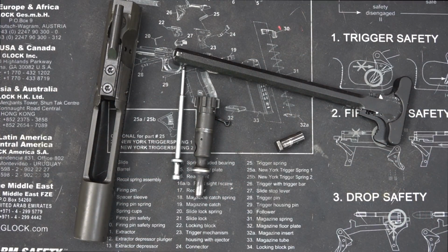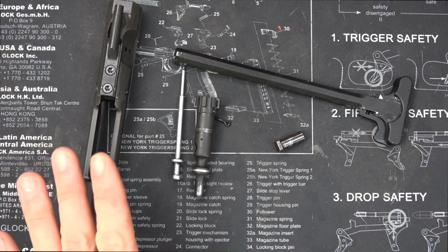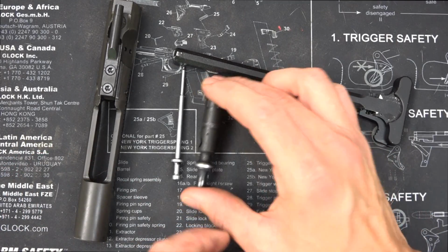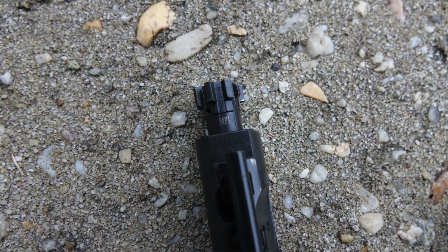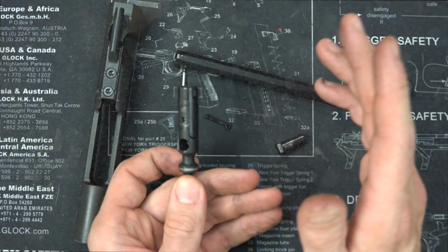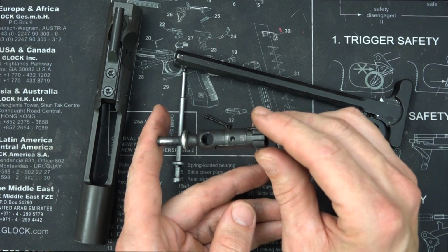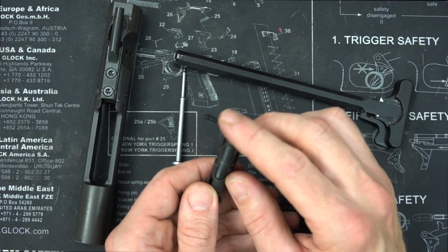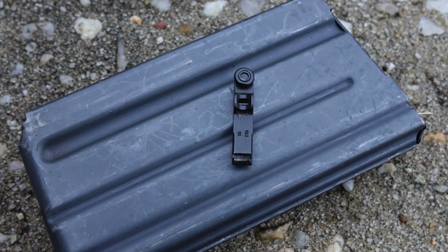The bolt carrier group certainly is one of the most important components on any AR, and this one's pretty solid. This one's manufactured by Toolcraft. The bolt is 158 Carpenter steel. It is, again, individually HP and MP tested to mil-spec, which certainly, again, you're not going to find on a lot of budget bolt carrier groups. It has the MP marking on there. And if you pull the extractor out, you'll see it does have the black insert there, the O-ring insert.